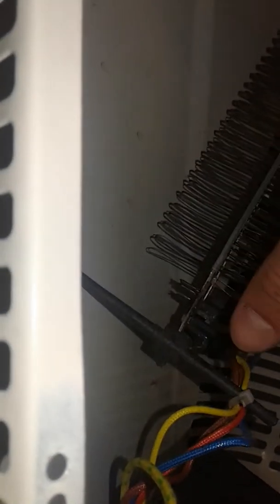I've bent these just by touching them - they weren't like that. I'm not surprised they even touched an earth connection - I knew that was going to happen. Must have been bad connections over time that wore off and then that happens. Winter's almost over in New Zealand and I've been using this over winter no problem. Then I just started hearing arcing, took a look inside, and even from up there you could see the lug was red hot.